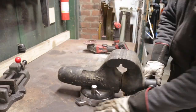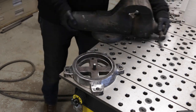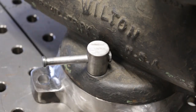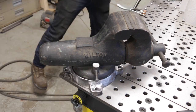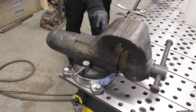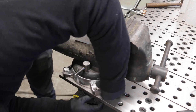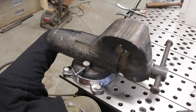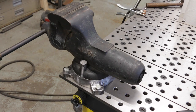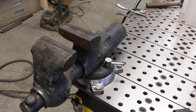You can see the way it's still able to swivel and everything looks really nice. Now just time for the final assembly — I didn't finish the base, that'll be for another video, but the way these little swivel locks look I'm super happy with. The way the base blended out I'm really proud of. It came out really great, especially considering it's the first time I've cut 3/4-inch on that machine. Once this thing is tightened down and you tighten those swivel locks, even though they're only about a 3 or 4-inch bar, there's so much surface area from that 3/4-inch thick spreader that this thing cannot move. This vise weighs about 65 pounds being a 5-inch vise and I think this base really complements it well.